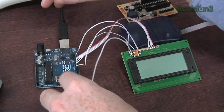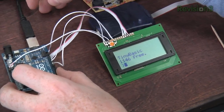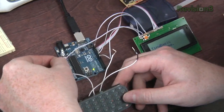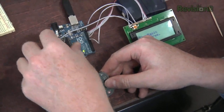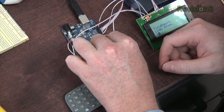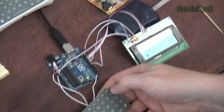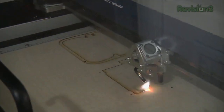Let's give this power, hook up the LCD and see if it works. Now we just have to hook up the keyboard. The keyboard has three lines — power, and remember the keyboard is a 3.3 volt device so we have to plug it into that. Then it needs a ground reference, and of course the data. We want to be receiving the data here. Let's reset it. Hey, look at that — Hello world! Alright, we have Tiny Basic working.